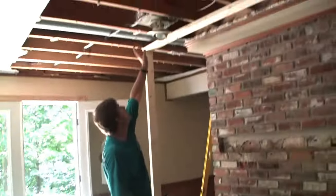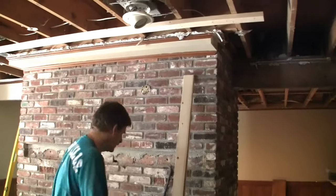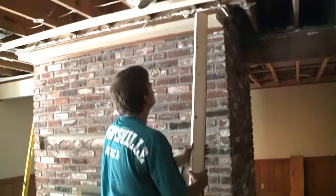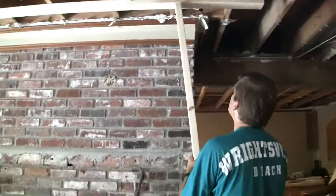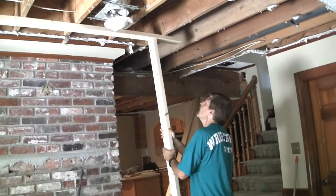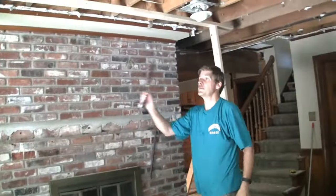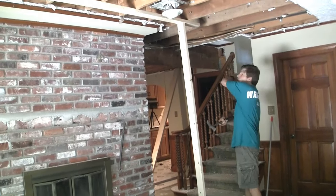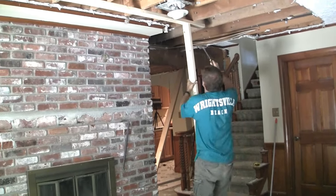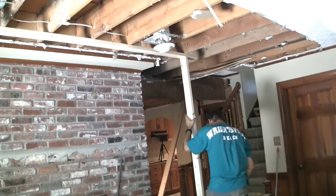That's one. We put one under each joist — seven more here to go. When we get all done, not only are we getting ready to do demo upstairs to take the chimney out, but before we put the rafter in, three beams are going to support the floor permanently. We'll have temporary walls that go the whole length on both sides to make sure we're taking care of that whole load that's above us.